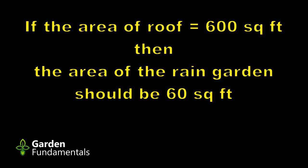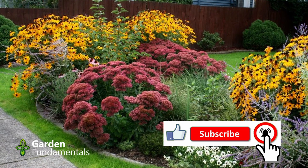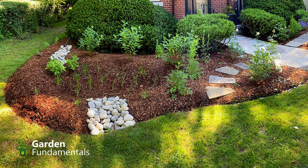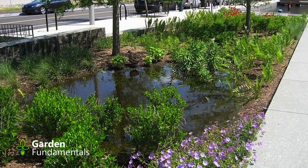Let's look at an example: if the roof area for one downspout is 600 square feet, then the area of the rain garden should be 60 square feet. Now these numbers are not that exact. The garden may be an oval shape — in that case just ignore the corners and assume it's a square. These numbers are also based on a one-inch rain event, which you may never get where you live, or you may get larger events. You can also make the rain garden larger or smaller than the calculated size to fit the space you have. We will add an outlet to ensure any excess water is directed where you want it. Even a small rain garden is better than no rain garden, so if you can't make it the size you need, make it smaller but fit one in.